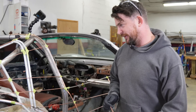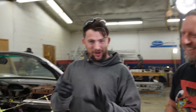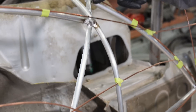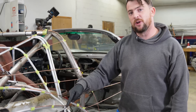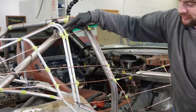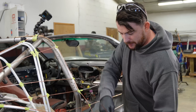We have a bit of an issue. The part line right here — the way it runs across this joint — is not the most opportune thing; the joint is in a bad spot. The workaround is I need to weld a little patch right here to make this tube continuous, but I'd also like to cut this tube back to have room for the adjacent tube to run in one piece. To do that I need to figure out this entire zigzag I've rigged up, because if I cut it, it's no longer attached to the clamshell. The solution: I've begun tubing forward at the hip, bringing it up along the roll bar, back over to itself, and we'll make tabs to hold this section to the roll bar in two places with a tab down here — that should keep this floating in place and not wiggly.